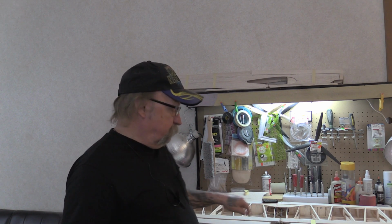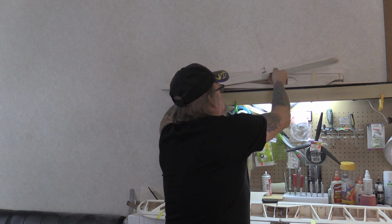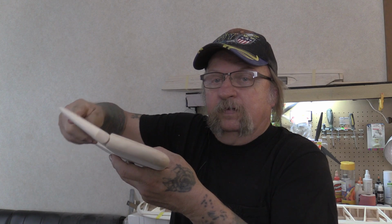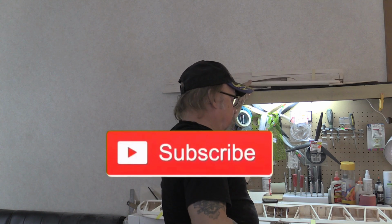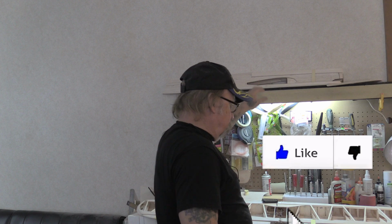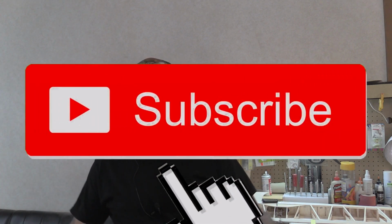These are the pocket hinges on this airplane, where everything's at 3/16 off the trailing edge, but the pocket is cupped just exactly like the stabilizer. So that's how that works. It's a good system, I think. They're really free. They flop around. You got 1, 2, 3, 4 hinge points per flap, and 3 hinge points per elevator. So that works real great, and the controls are real free, and they just flop. And that's the way you want them.